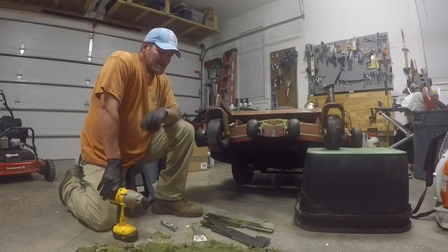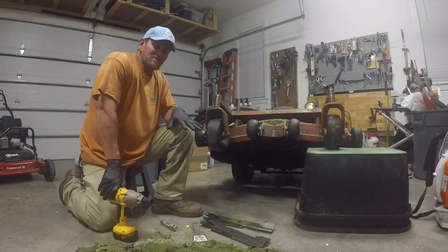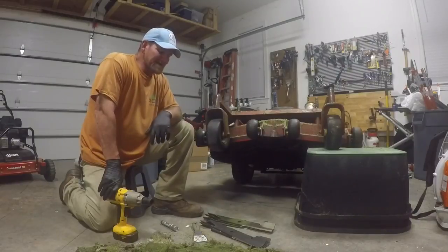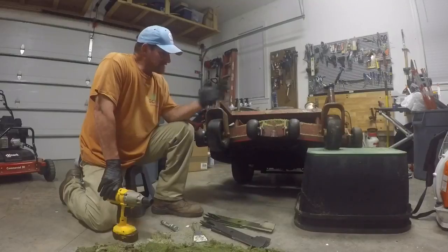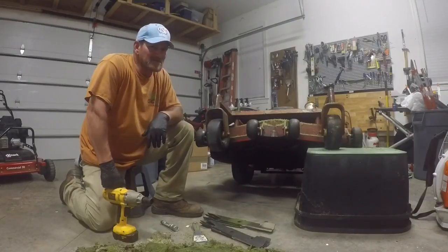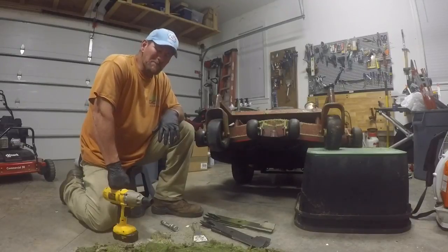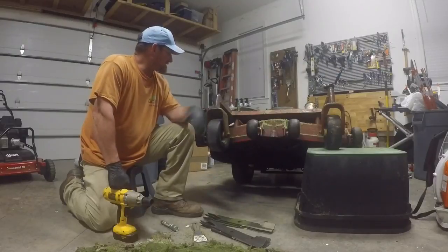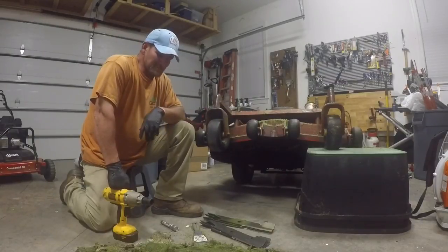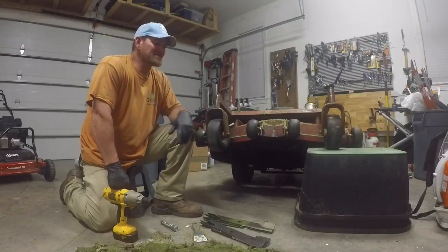Homeowners, sharpen those blades very often — the more often the better. It's going to help with the quality of your turf. Commercial guys, you owe it to your customer. Keep your mower decks as clean as you can. If I had more time I'd clean my deck every time I cut, but I clean it about once a month during the cutting season — I just prop the mower up on cardboard and scrape it off. I'll put a link to the Magnematic in the description. Thanks for subscribing and we'll check you later.